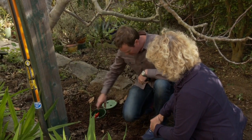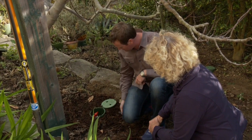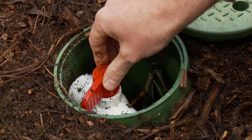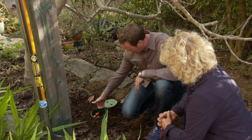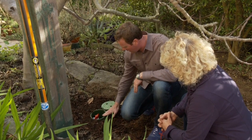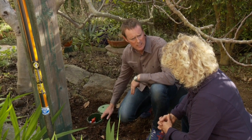And basically underneath where I'm standing right now, if you envision there's this tubing, it's buried under the soil and it's staked down, and it gets emitted 2 inches beneath the soil surface. And that's really important because that's what the code requires. This box does that duty. It keeps it above the soil surface so it doesn't block, and also keeps it 2 inches beneath the soil level so it doesn't cause any health risk.